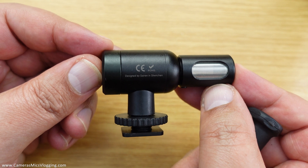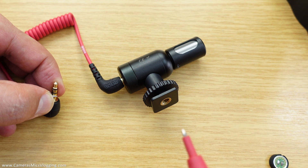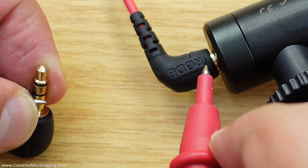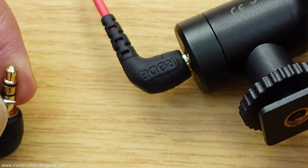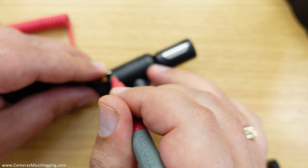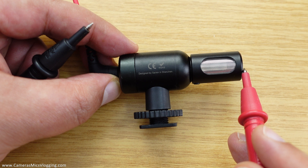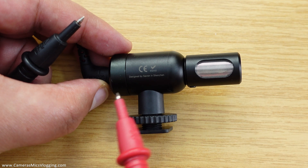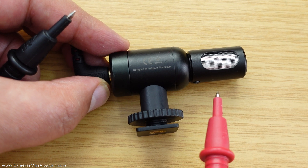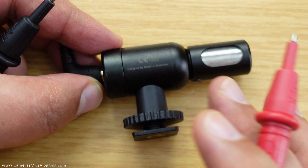Let me do a quick continuity test for ground, earth, black, or negative — whatever you want to call it. I'm going to go straight to the back of the body. There is continuity straight to the back of the body. However, touching the body itself — nothing. It appears to have some kind of anodized coating. The reason I'm doing this is to see if the capsule was being floated inside the body for any particular electrical reason — it doesn't appear to be, because I can get ground straight off the back, and that back is joined straight to the case. This is just out of my own curiosity and might pique curiosity for other people as well.